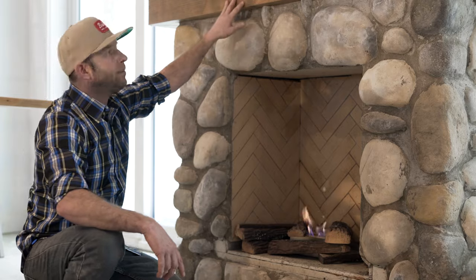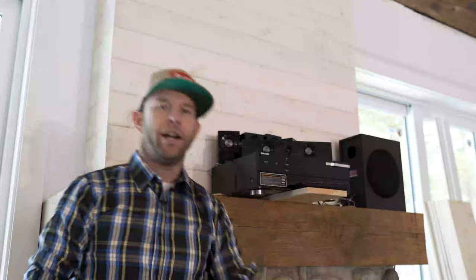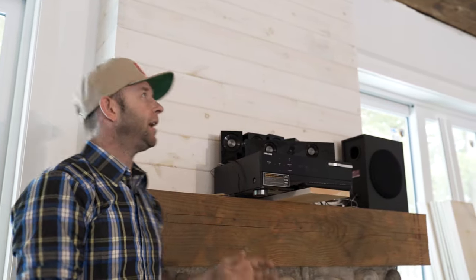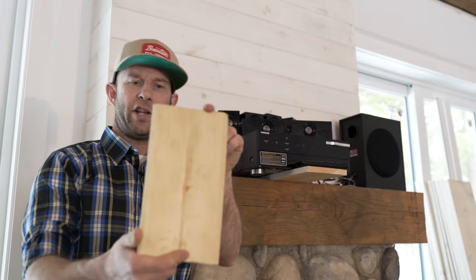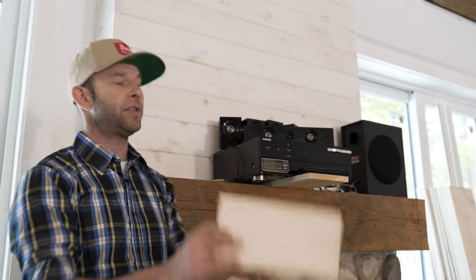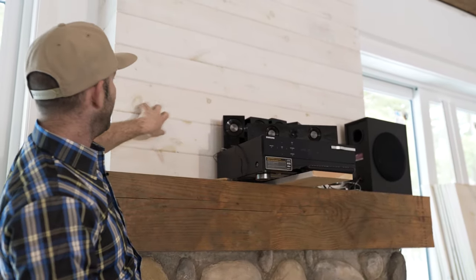So we get a real flame inside what looks like a real old-fashioned Muskoka fireplace, and we did it at an exceptional value because I got the stone at a garage sale. This beam is a miscut from when I did David's timber frame porch. This is our fireplace chimney breast — it looks like a chimney goes up there. We did it out of a cottage favorite known as V-joint pine. We've stained it with our whitewash, which is just watered-down white paint. It's only got one coat on it now, but you can see the knots showing through so you still get the feel of the wood. It's nice and light — it doesn't darken or yellow like that honey stuff from the 80s does.